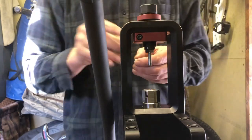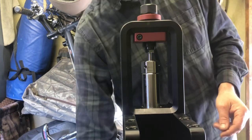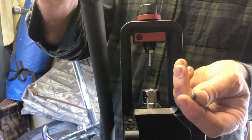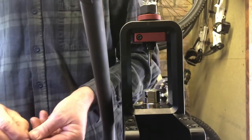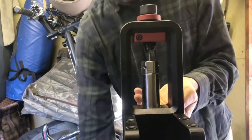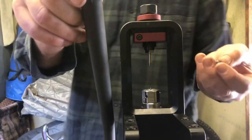It's extremely easy. All we do is take one of the little billets, drop it into the die, push down — it acts like an extruder — and it pops up and we've got a nice little hollow point. Again, take a billet, drop it in, and out it comes.